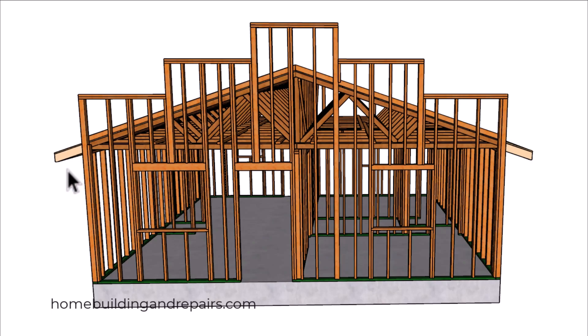You're not going to want to see the roof, and in some cases you won't want to see the side fascia board either. To fix this, all you need to do is extend the wall framing out a little bit or bring the roof framing in a little bit to hide the fascia board.